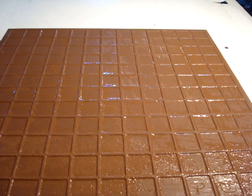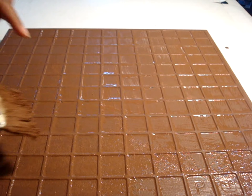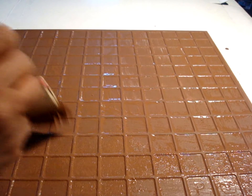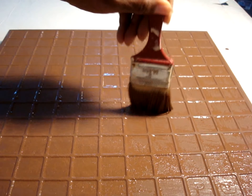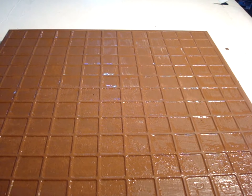I painted the back and as you can see it's starting to dry, but you can also see some of the paint sticking to the waffle areas on the back of the board. In order to get those to dry very quickly, take your paint brush and just tap those down — you're basically spreading out that paint. In just a little while, maybe 20 minutes or so, this is going to be dry. And that's how you get the chalk paint to dry a little bit faster.